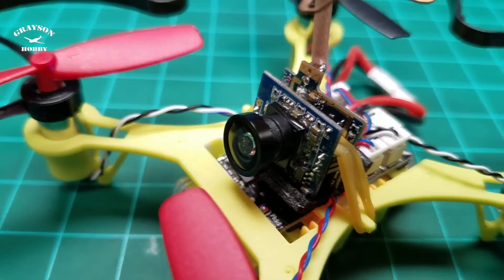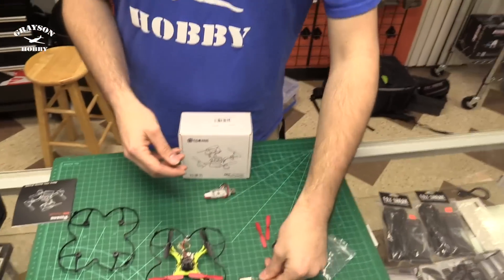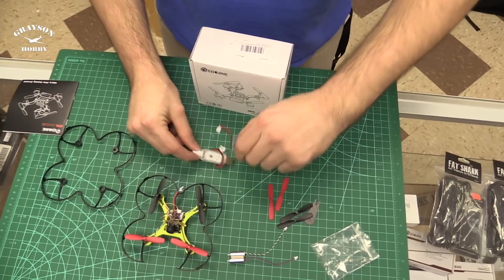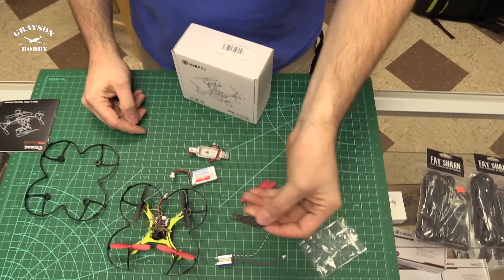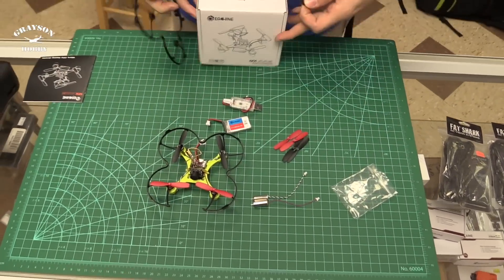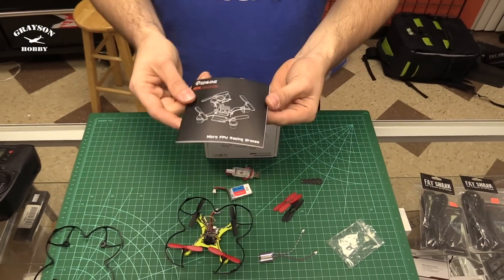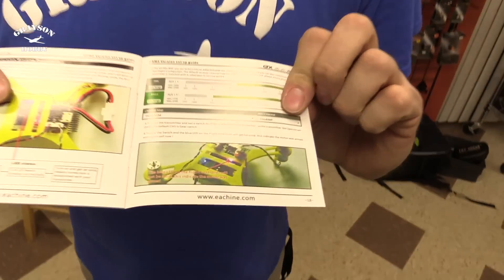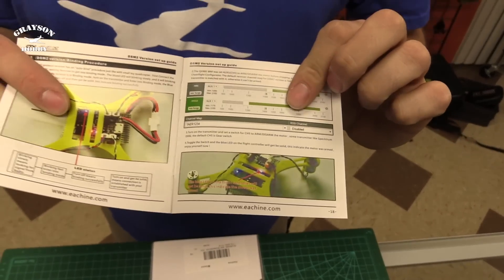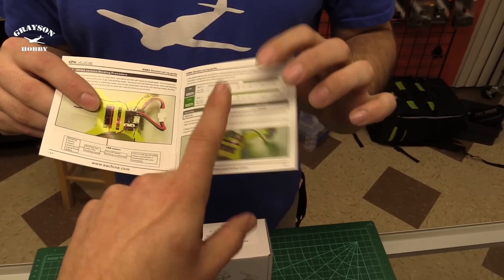The camera is the same as the QX90 and QX95 from what I can tell. The battery is a 600 milliamp one-cell lipo — link is below, we'll have those available. In the box you've got two spare motors — a clockwise and a counterclockwise — your one-cell charger, the battery is generally already in the quad, an extra set of props, and a little prop wrench, which you'll need to pop the props off to put the cage on. Eachine is surprising us with an actual manual. For the Spektrum version, you'll need to set your endpoints in Cleanflight and probably reverse two channels on your Spektrum radio depending on which one you're using.